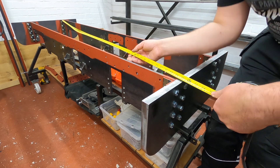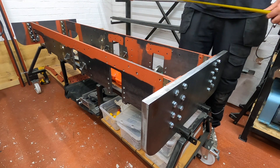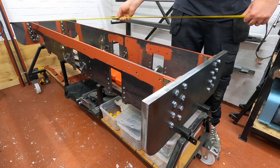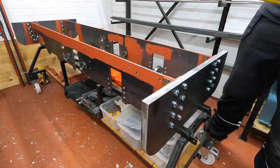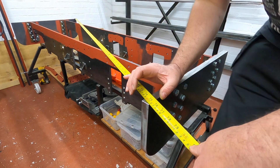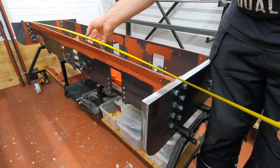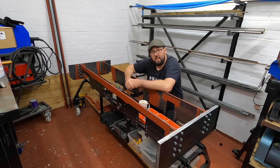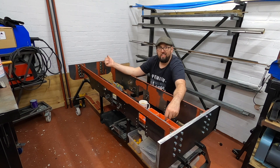Measuring: 1789. We'll go outside to outside: 1921, 1920. So half a millimetre on the outsides. I've finally got it together. The problems I encountered definitely took a little bit longer to rectify than I thought they would. At the front end it was a case of just undo things and tweak it a little bit until it went, but that end was quite far out.